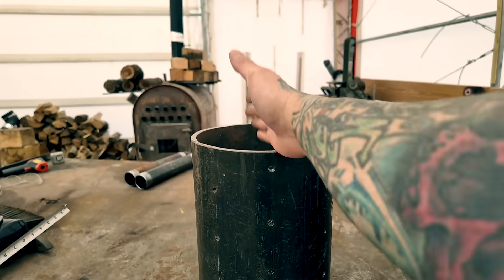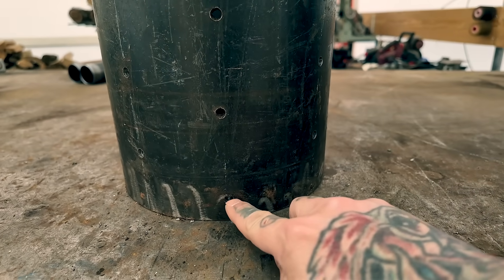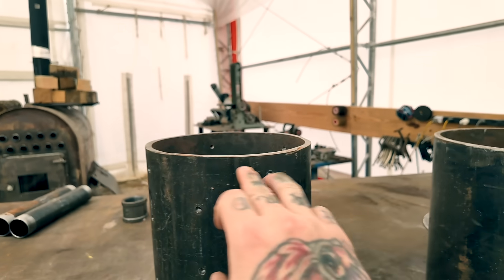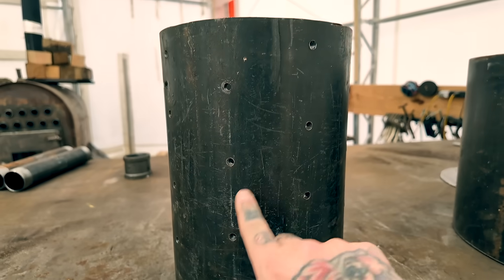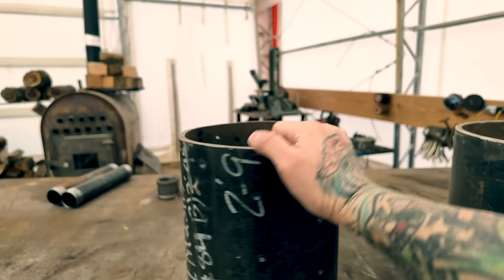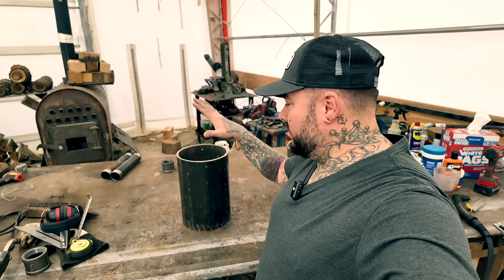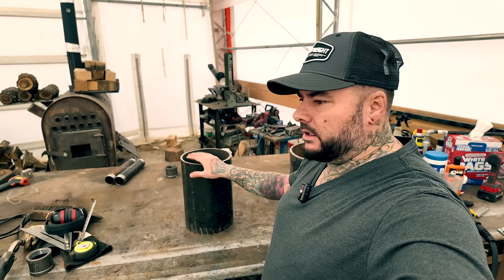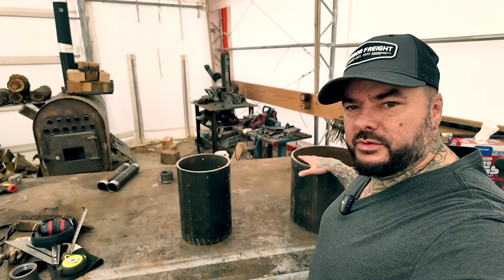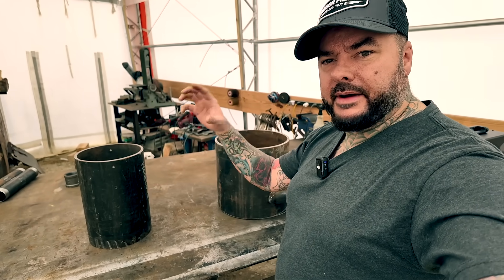After about an hour of drilling, I got the inside pipe done. I measured out four columns, dropped a line down, and drilled five quarter-inch holes all the way down — stopping an inch from the top and bottom. Then between those rows I drilled four holes staggered in between, giving me holes equally spaced all around. Next I'll weld the tube to the bottom plate solid, slide the big tube over the top, and just tack it around the sides for now.